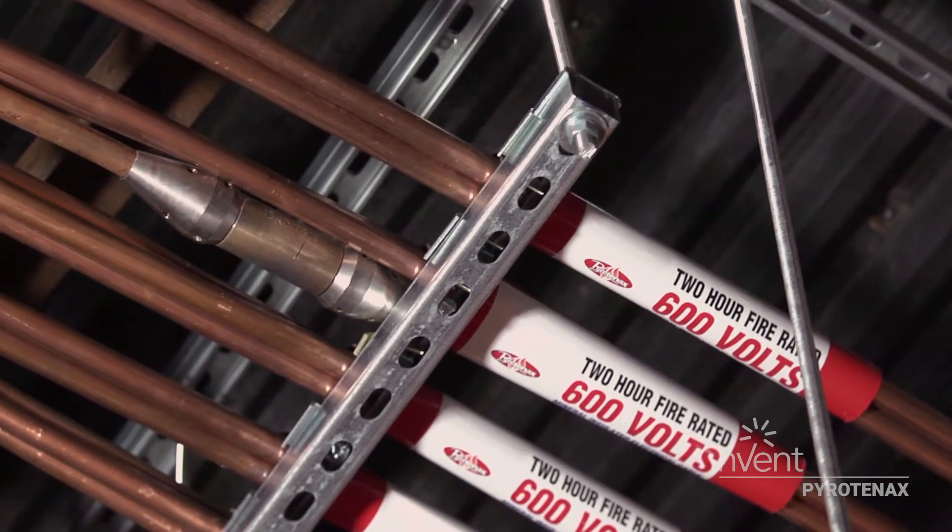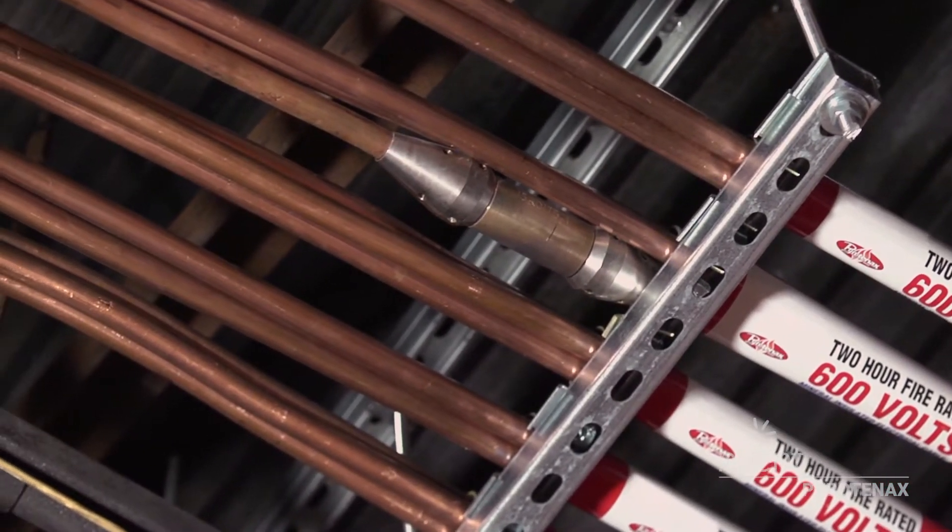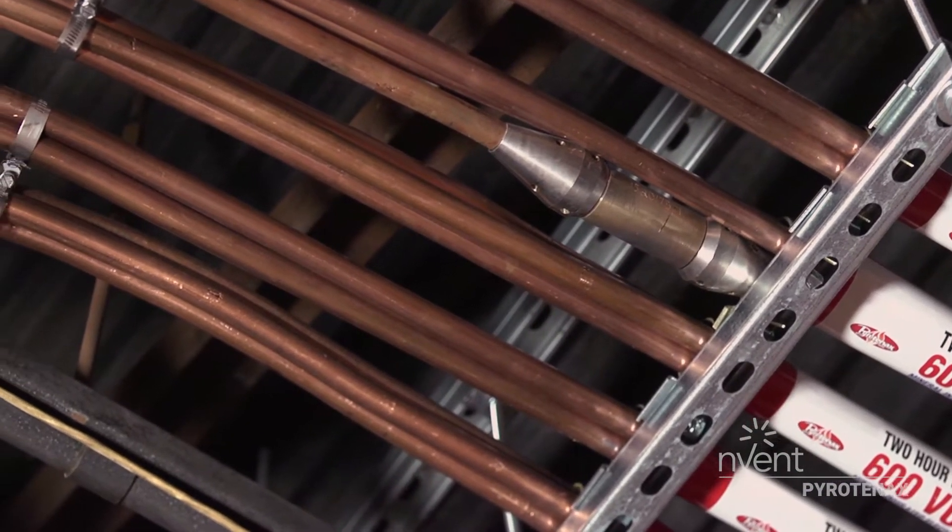You don't have to pull in various locations — you can do one constant pull. We set up seven sets on one of the poles, and that's considerable. Our longest pull was 510 feet. You don't have to worry about making a splice — the factory splice that comes with the MI was amazing.